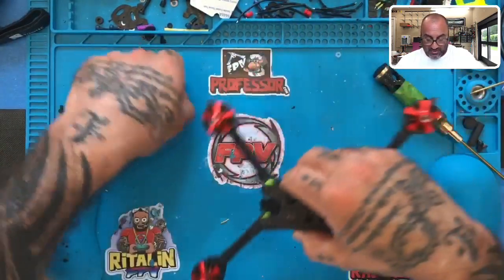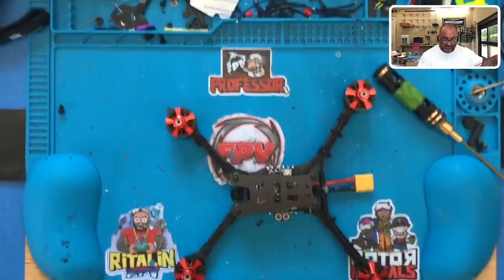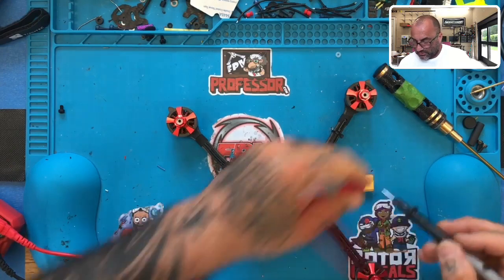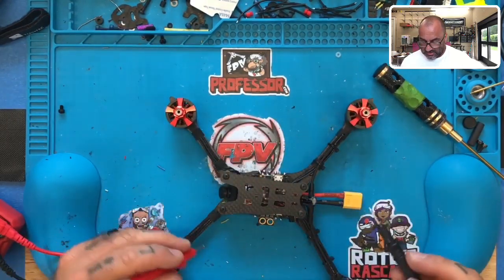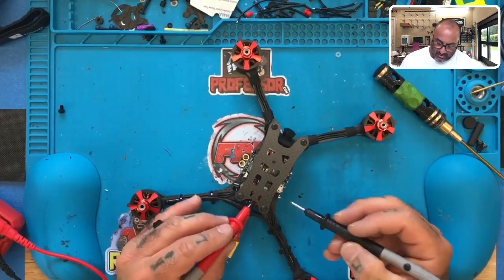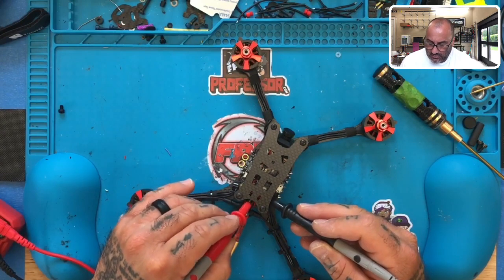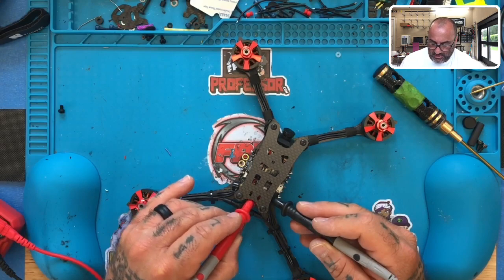So what I'm gonna do now is, before I end this part of the video, I'm going to go ahead and just make sure we test our continuity. Okay, want to make sure. Okay, that's good. And let's test our 5-volt ground. Here's our ground. It's not touching, and here's our 5-volt. And we have a very good and secure 5-volt ground. If we touch it together, perfect.